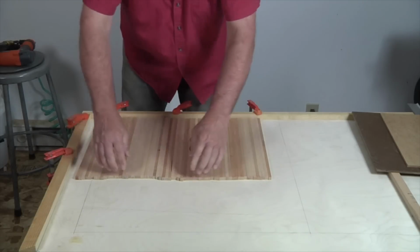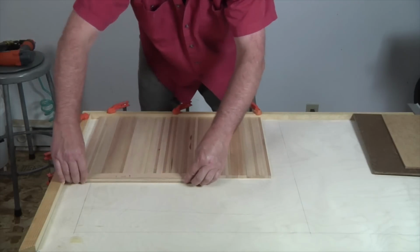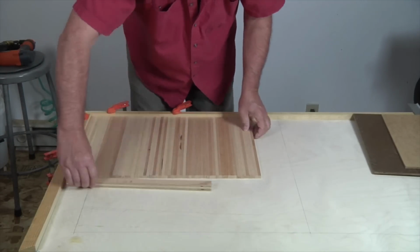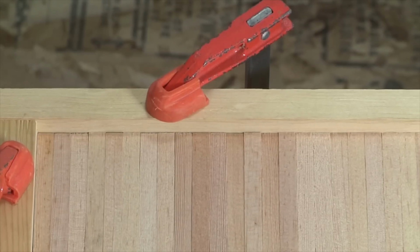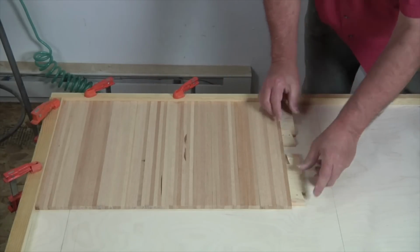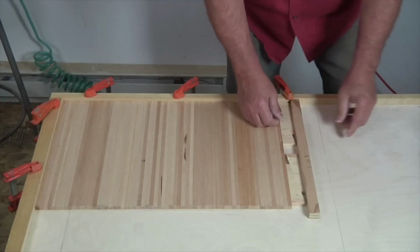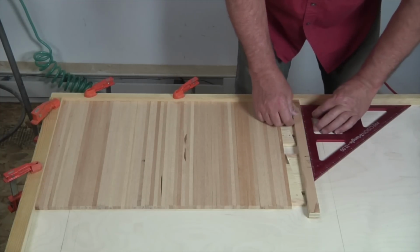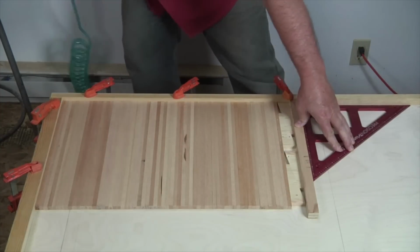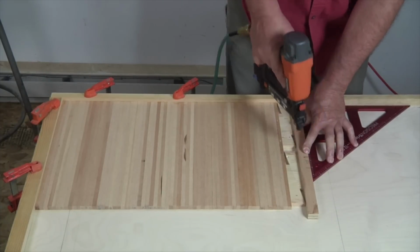Bring the slats together and slide the assembly against the two alignment strips, which have been clamped perfectly square to each other on one corner of the assembly board. Make sure all the slats are pressed tight and flush against the strips. Next, place two pairs of complementary angle wedges made from thin scrap wood against the end slat. Then butt a stick up to the wedges, making sure it's square to the alignment strip. Secure the stick to the board with a few nails or screws.